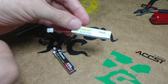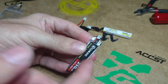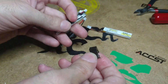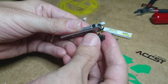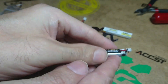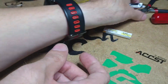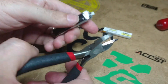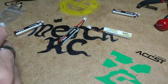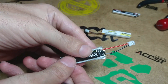I'm going to convert some batteries — the Eachine QX65 batteries. I've already taken the plastic top off them, but I found a big major problem. The biggest issue was this silicon at the front, and at the back they used CA glue to glue the rest of the plastic caps on. That was a nightmare to get off, and I had to use wire cutters to snip the plastic off — you don't want to puncture the batteries in case they go up in flames.